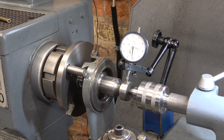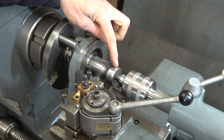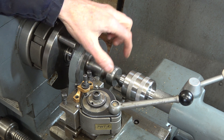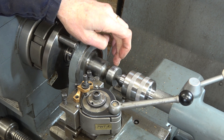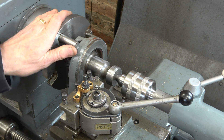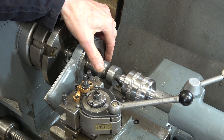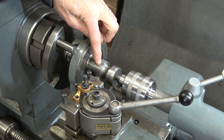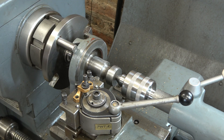No wonder it's binding. I'm just taking the tiniest scrape off this — it may look eccentric but I think it's more of an irregular egg shape somehow. It's just scratching the surface here and just on this section. I'll do a bit to there and then try it in the ram and see.